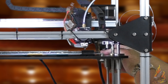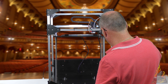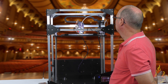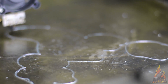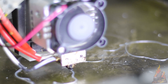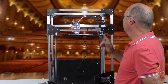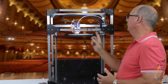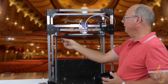You can do this by adjusting your Z height figure or you can just use an adjustable Z stop. So we'll try that again — right, we're off and printing now. And that's not looking too bad. That's sticking down nicely. We're a fraction high possibly, but you can adjust that as I showed you before. One other thing for your fine tuning: if you get something off Thingiverse or somewhere like that with a large footprint, start to print one of those and you can adjust your screws as it's printing the first layer to get it absolutely perfect.